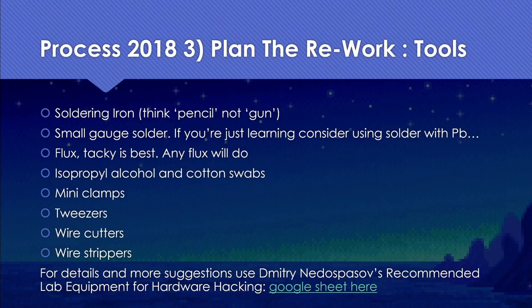What kind of tools do you need? Nothing special. You need a soldering iron — think a pencil tip — some solder, flux, and all the stuff you'd expect. When you get your wire strippers, make sure you get ones that support 30 AWG wire wrap wire, because it's very small and hard to strip. If you're building out a lab, I highly recommend Dmitry Dino Spassov's Google Sheet, where he tracks all kinds of different options for buying at low price and also high price. We'll post a link in the chat or the deck will be available.